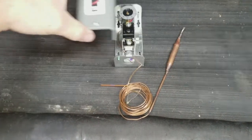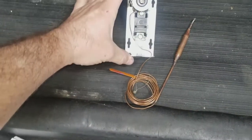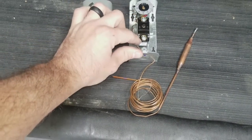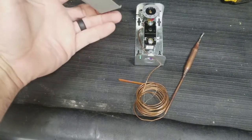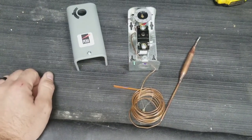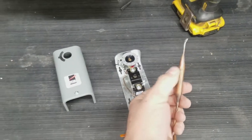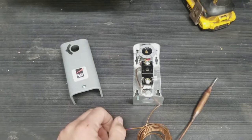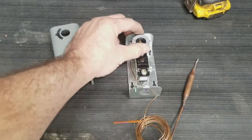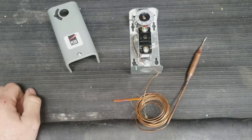This guy, I have to say, is the number one most common temperature controller that we use for walk-in freezers and coolers. It is a Johnson, or PEN, temperature controller made by Johnson. This particular model is just the single pole single throw model, but you can get it in a single pole double throw. Very versatile — the sensing bulb is a little bit bigger, but you could theoretically embed this in an evaporator coil and use this as a constant cut-in control. I wouldn't suggest it because you'd have to bend the fins pretty big to shove this in, but I've seen it done. Anyways, this is a very broad range control — it goes from 100 degrees down to negative 30. Very common truck stock item. I usually keep one or two of these if you're doing a lot of walk-in work.